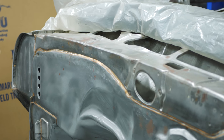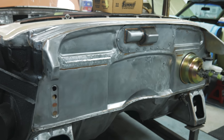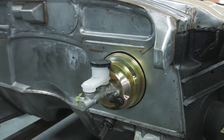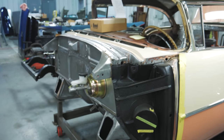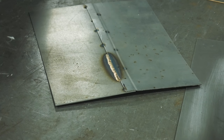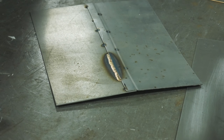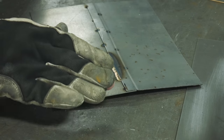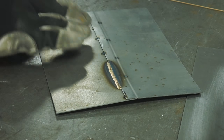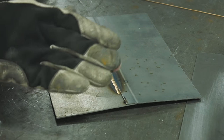When you're welding lap joints on these unibody cars, you need to scrape out that seam sealer as much as you can. Because if you don't, you're going to play hell — and I do it all the time. Even if you think you got it all out, I compare it to soldering copper pipe when you think you got all the water out. As soon as you strike the arc, whatever seam sealer is left under that joint will come to the edge and blow out your weld. In that scenario, you just got to deal with it — you got to weld it. My welds on a joint like that look like they're garbage, but they're not. I'll weld it, grind it down a little bit to knock out a lot of the impurities, wire brush it, and then wash over it again.